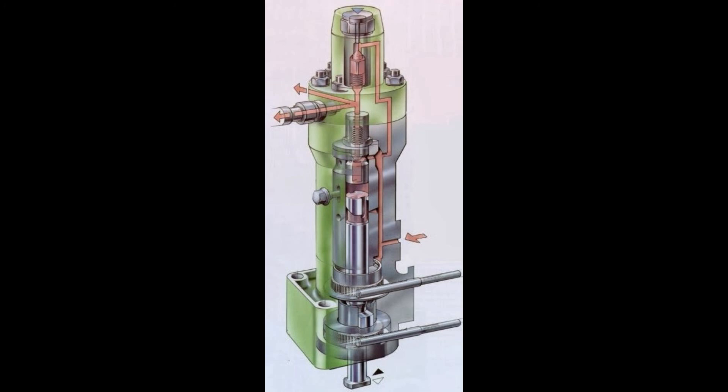As a result, the pressure inside the fuel injector is reduced. Because of this reduced pressure, the fuel is not able to open the needle valve, so fuel injection does not happen. This is why the engine stops after some time.